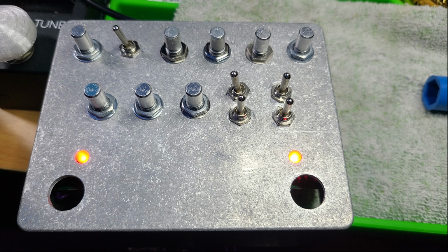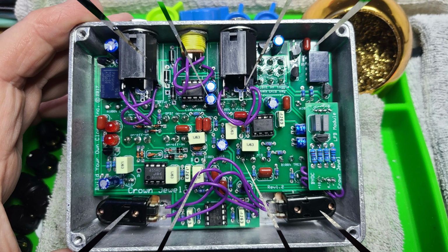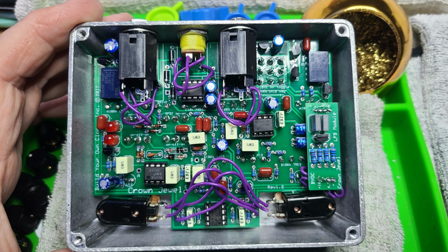Then you have to work everything out, plus the input and output jack. Plus you have to unsolder the power plug to be able to remove it from the chassis, to be able to remove the printed circuit board. So a lot of work to take it out. Then I went through it with a fine-tooth comb, and I left everything except the power soldered together.